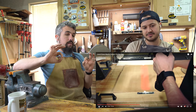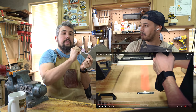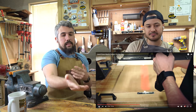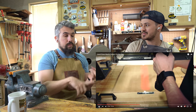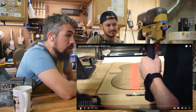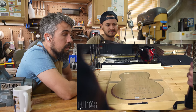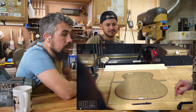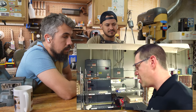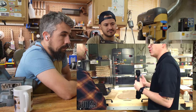You can actually see individual pockets inside the wood — maybe it looks good on this side and that side, but in the middle there's a void or a piece of sap that you won't know about until further down the assembly line process. He's basically saying we only let our best wood go toward our D45s. What you can do is take a form like this and see if it'll fit on a smaller guitar. If for some reason it doesn't pass any of those inspections, we take it and use it for the center strip.